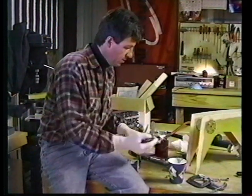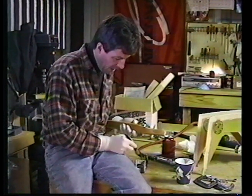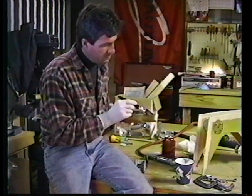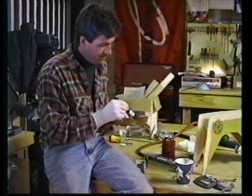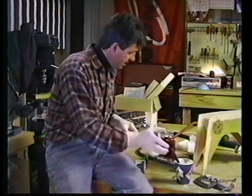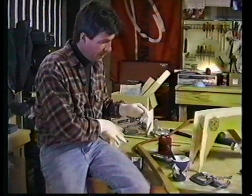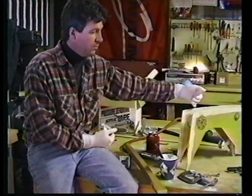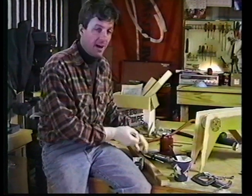We're going to brush resin, of course, on the areas that we've sanded. In the back, we're going to fill this depression here in the middle with flox. And then put enough flox in the middle so it will squish out in all quadrants. And as I mentioned before, we're going to leave 1/8 to 3/16 of an inch of the top portion of this strut sticking above the casting. It's important that you don't do more than that. It will get in the way of how your gear pivots and cosmetically closes the top of its travel when your gear is retracted. There will be a cosmetic cover that goes over top of this, a plate on the exterior that will mate to the exterior of your aircraft, and it ducks in. If your strut is too long, it will strike the NG31 bulkhead, so make sure it's not more than 3/16 of an inch. We're going to mix up a quick batch of flox and be back with you then.